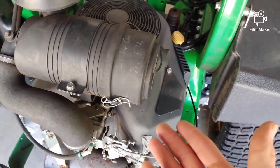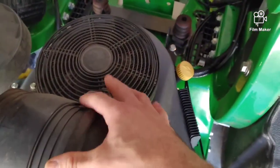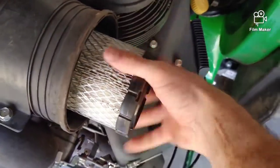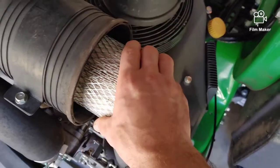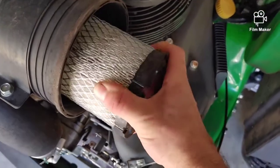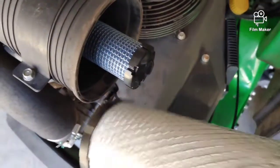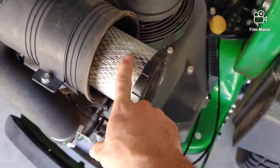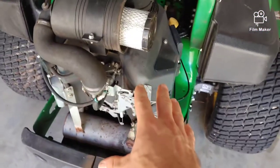The next simple thing that people would overlook that would cost them lots of money would be not changing the air filters often enough. You have two air filters. It was so rare that someone would bring in a unit and the air filter was even okay — a lot of times it was just clogged up with dirt. This is the outer filter, and then you have the inner filter. Most of the time they would both be just junk. This is $20 to $30 worth of filters that can save yourself a $3,000-plus engine.